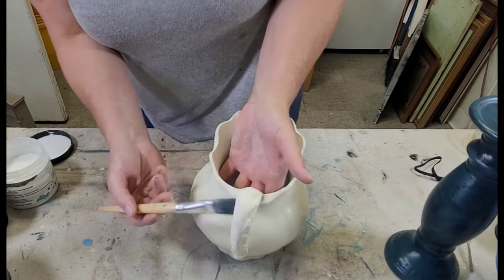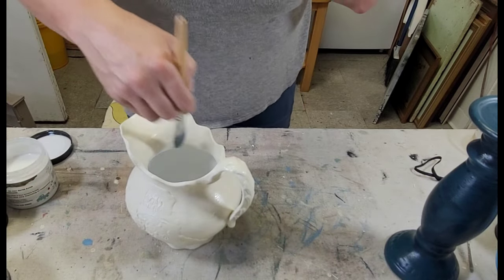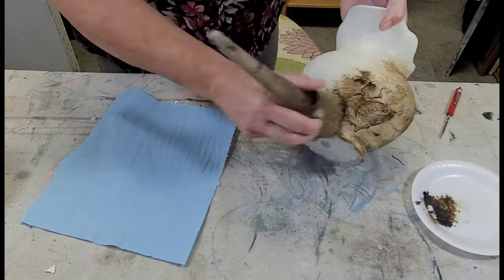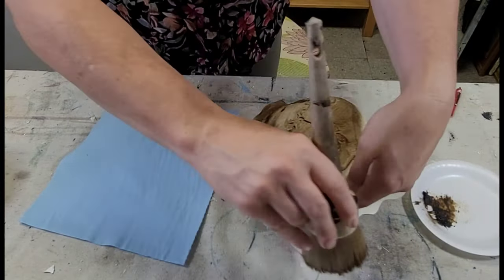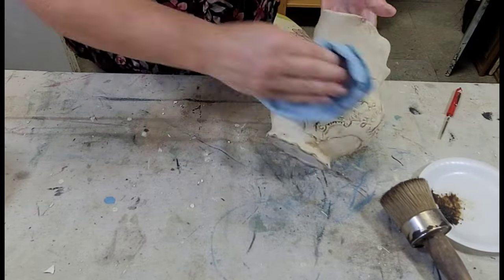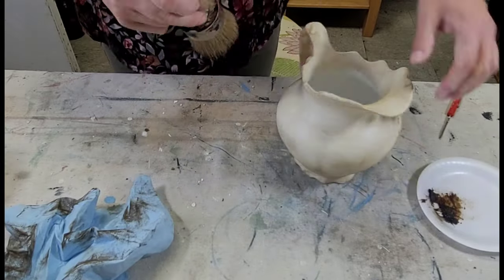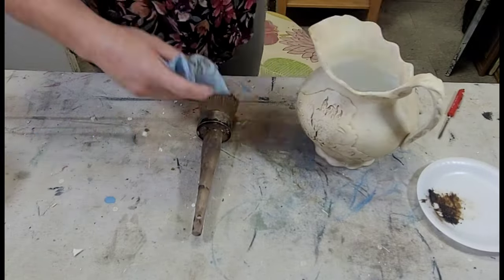I always recommend that under dark and black waxes you put either clear wax or Big Top down first — it makes moving the wax around a lot easier and does make a difference with these darker waxes. Here I'm just brushing one good even coat of dark wax all over the piece, making sure it's really well seated in all the grooves on the front. I went over it a couple of times in different places to give it a really nice aged, grungy appearance. I really wanted this to look more antiqued and I love how it turned out — I hope you guys do too.